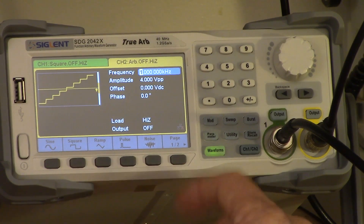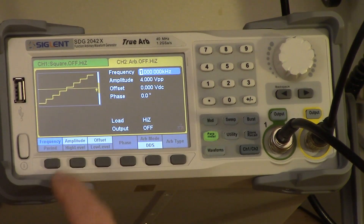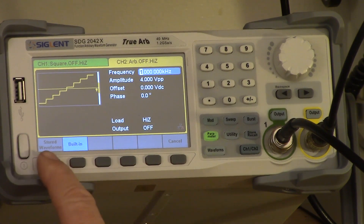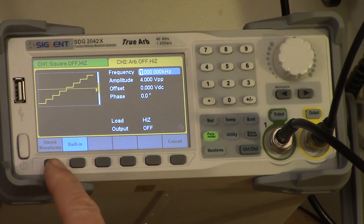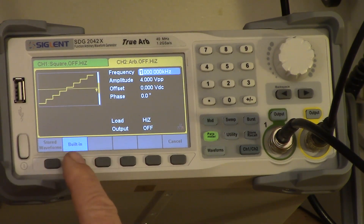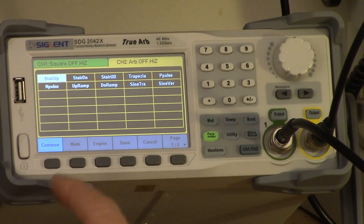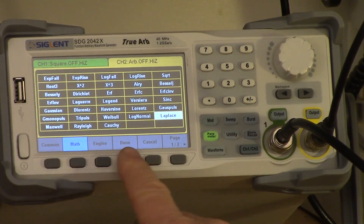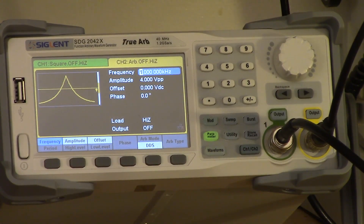This is an arbitrary waveform generator, and it will allow us to work with several different kinds of arbitrary waveforms. I have a choice — I can hit the arbitrary type here and choose between stored waveforms, which are things you design on your PC with their so-called EasyWave software and can be any shape at all, or there are built-in waveforms you can use. There's a staggering number of them. For example, from the math category there are all different waveforms — I don't know what half of them are. If I pick Laplace, you can see what shape will be generated, and of course we can modify all kinds of parameters like frequency, offset, and so on.